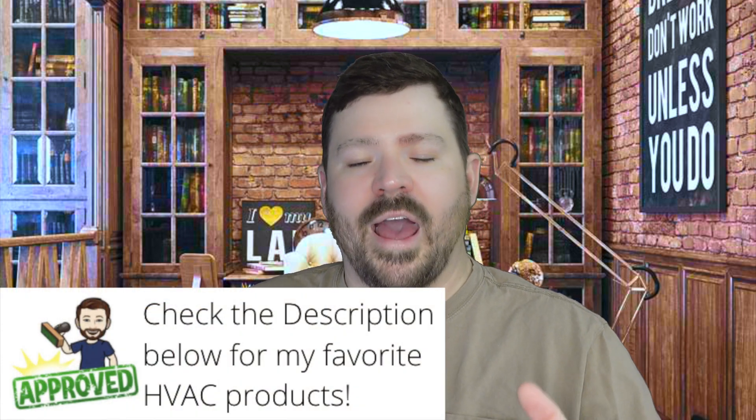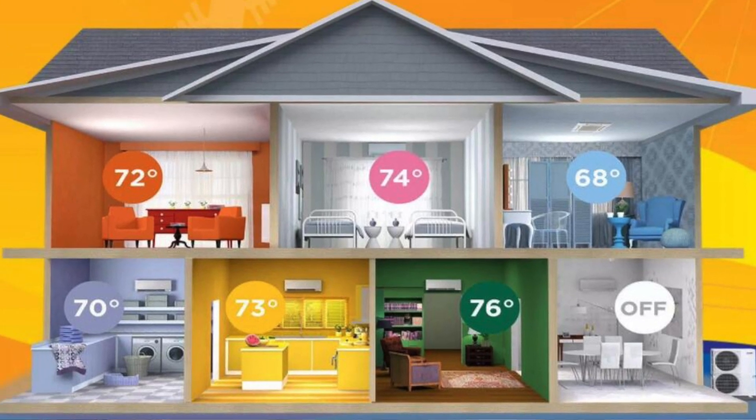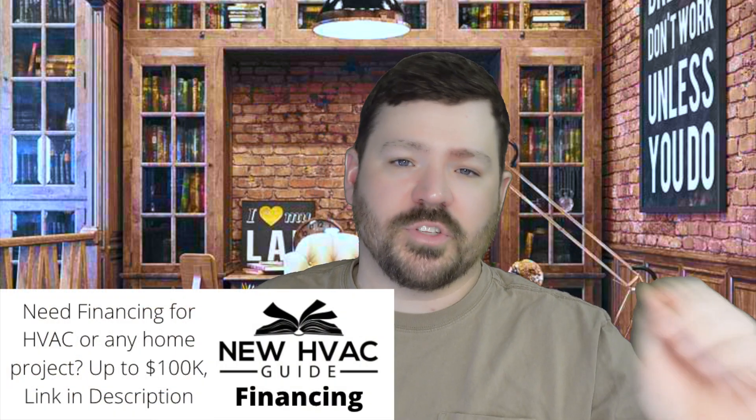If your home has multiple zones — a room you spend a lot of time in needing full heat and cooling, and other areas needing less — there are real energy savings there. Take a garage: by code it cannot be connected to a conventional ducted air conditioning system because of carbon monoxide concerns. With VRV Life, you just run a line from that outdoor unit to a wall-hung mini split for the garage alone. The system can also operate at low ambient temperatures.